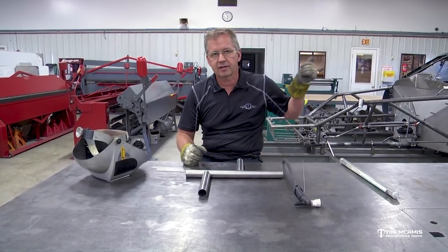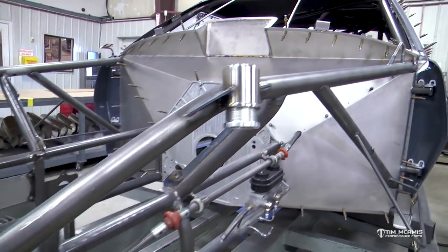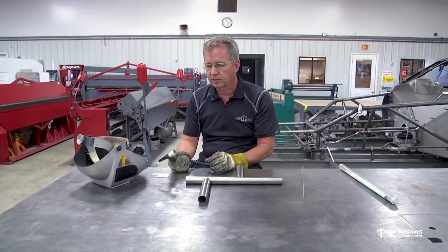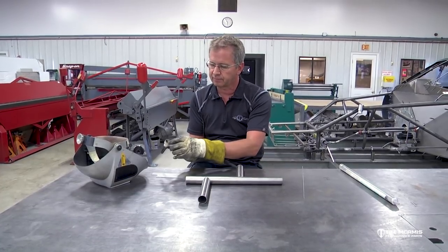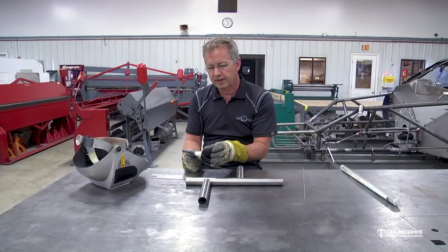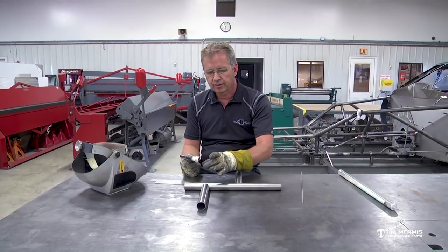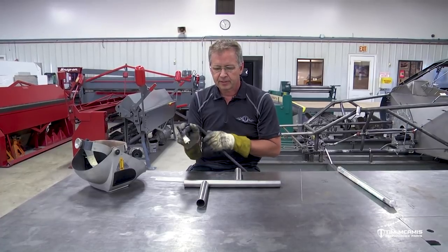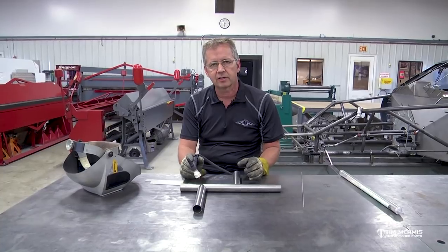For instance, this chassis behind us — it's got a titanium back half on it, it's got a lot of titanium components. You can't put the whole thing in a chamber. So again, we go back to these cups, which are these large diameter shielded lens cups. They've got the little shielding filter in there. These will provide a similar effect on the titanium as they do on the 4130, where you're going to get a larger argon cloud around the weld. And it's really important for the titanium weld to be immersed in argon.